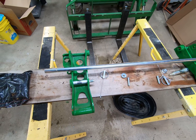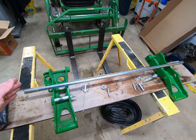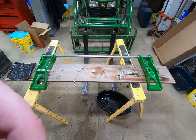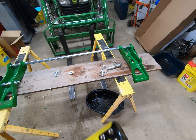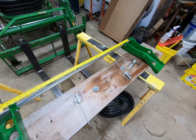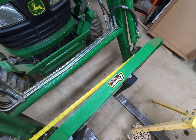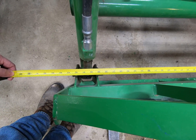The first challenge is not knowing how wide the kit is. A one series is very similar in width to an x748, so I set this up as it would be installed and took measurements. Going middle to middle, it looks to be about 40 and a quarter inches. If we go middle to middle on the 45 loader, we're looking right at 40 to 40 and a quarter inches as well — so they are the same width. That's actually really good news.